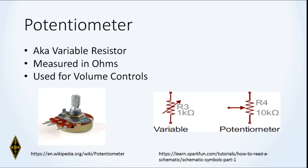A potentiometer — also known as a variable resistor — generally has three terminals. The volume control on your car radio may be a potentiometer, varying the resistance between elements, making a voltage divider to control the volume of an AC signal. Potentiometers come in different resistance values and are used for volume controls or other control circuitry.